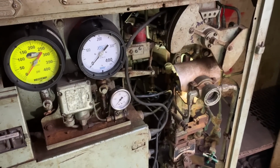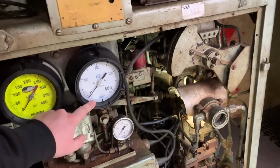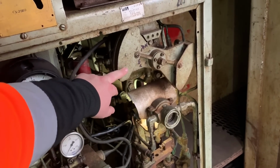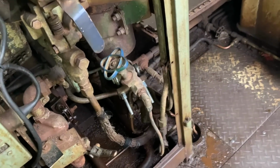You turn the water on down there. These are the cocks to make sure that you have water in the tank. Our water level is somewhere down here. Then our control panel is here. You've got steam pressure and the train line pressure. So this is the boiler pressure in the water tube boiler back there. This is the fuel governor. You got a sight glass there to see if you got water running through. Air control, water.